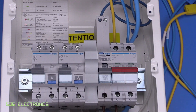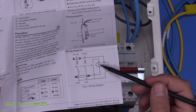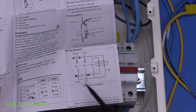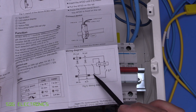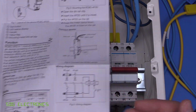This single width unit has all of that built in and it is also a double pole disconnect. So you've got your RCD, arc fault detection, thermal overload and also over current detection. A couple of current transformers on the output as well as the current transformer on the phase in and neutral for the RCD functionality — everything all built in.